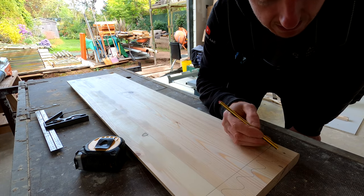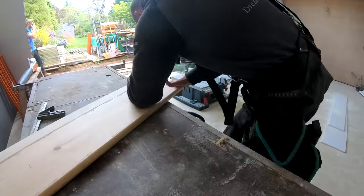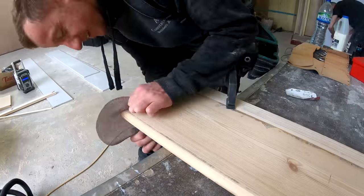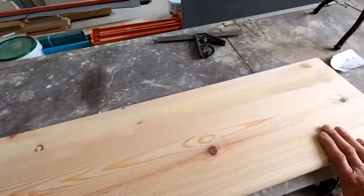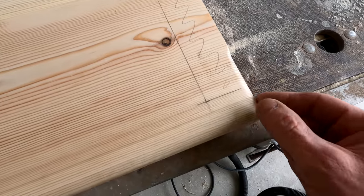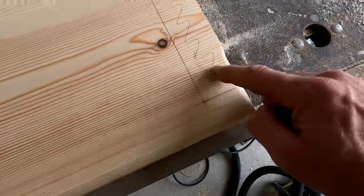I can just bring the router past to this point and then trim that off afterwards to get a nice clean edge. I haven't got to worry about trying to route on a tiny little bit, so I'll get my router set up and get this done. Now I've got these rounded over — nice round corner right the way through. Just had to do a bit of fettling to make sure they're exactly how we want them. Because I left this chunk in I've been able to carry on through with my router to give me a nice edge — the last thing I want is to be balancing the router precariously. So all I'm going to do now is get this section cut out, this section cut out, and then we'll see if it fits.